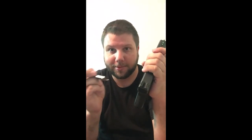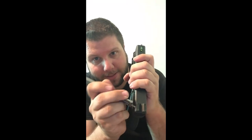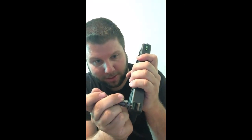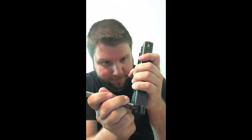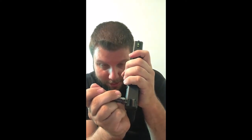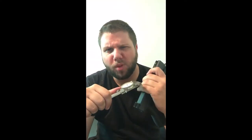For the other side, point it over your shoulder and up — same technique. Get down in there and rotate it slightly if needed to get away from the serration. Slowly come in until it touches. I got 130 on that side, so there's six thou difference — that's quite a bit off. I normally like to get it within two thousandths, but I trust my depth mic which said it was within two.